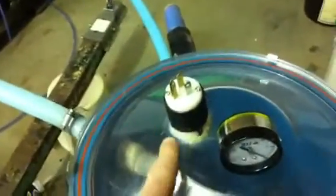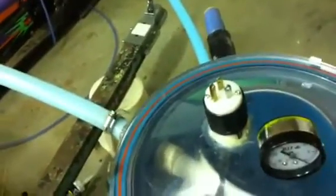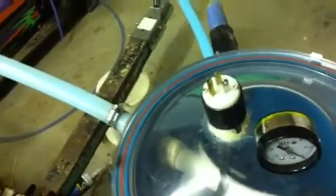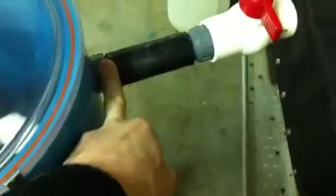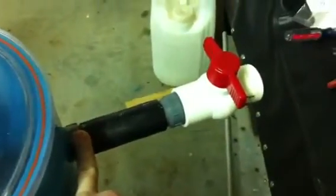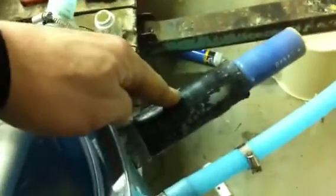When this is hooked up in the pump house, I'm going to have a short extension cord run from here over to the wall, which is about five foot away, so I can plug my continuity switch directly into the outlet. What I have over here is an inch and a quarter dry line going out to my wet-dry system, and I have a one inch wet line coming into the releaser. Coming around, I have another inch and a quarter dry line going out to my system and a one inch wet line coming in.